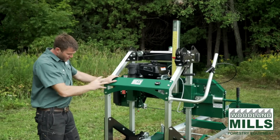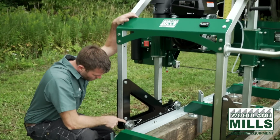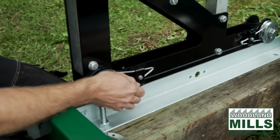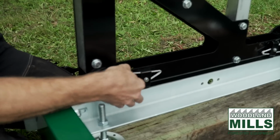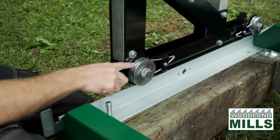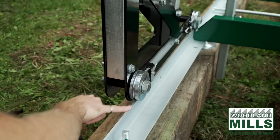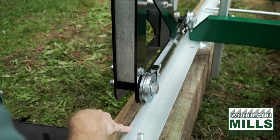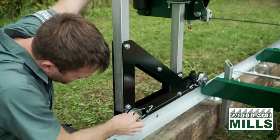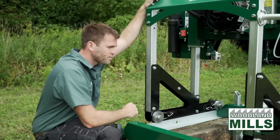On that 4-post, we've got our roller wheels that run on the track. We've got our stainless steel sweeper wires here, so nice and simple. These are adjustable, so you could reset them as they wear, but they've got a really long service life. We use a radiused machined groove in these wheels, and they hone into the top of the square rails over time, making a matched set. Again, we've got press sealed bearings inside of these wheels, so you have a nice precise fit and a smooth roll.